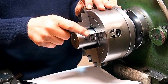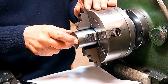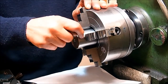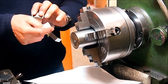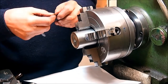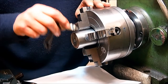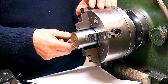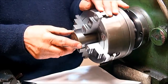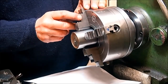That's made a big difference. That's the jaw I've just milled — we had an 8 thousandth gap under there before, and now we're down to probably half a thousandth. Yes, that's a one thou feeler gauge and I can't get that under there. I can just get it under there, so we're on the right track. I'll do this jaw and that one, and then I think we'll be in a position where we can grind the jaws in situ.